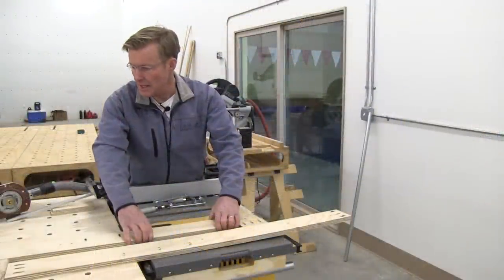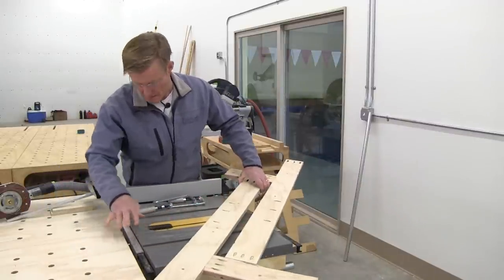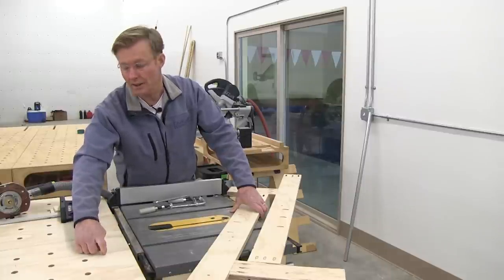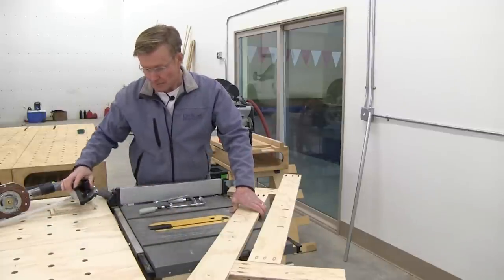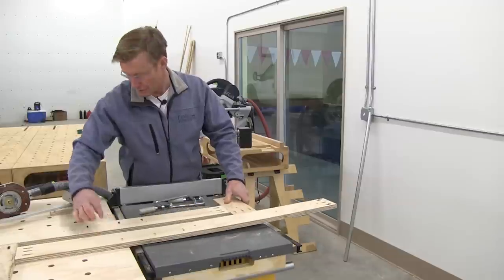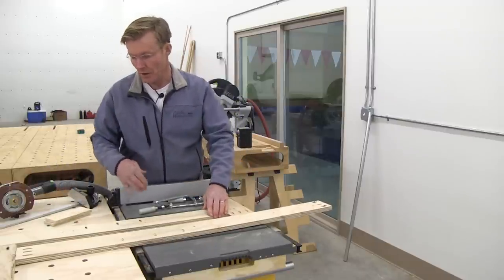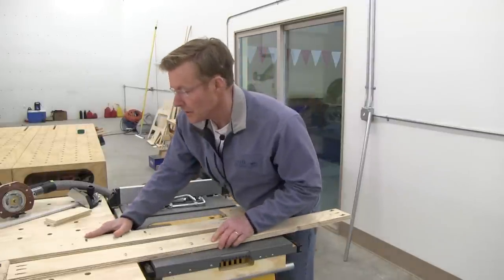The last detail on the workbench is to cut out the dados here for the miter gauge. I just took a straight edge, lined these up, and made marks where it needs to go. I'm going to make the dado actually wider than that and a little bit longer than I need — there's no need for this to be a tight fit, it just needs to be a run-out. I've taken this same pattern I used for the other cuts and adjusted it — made it an inch and a half wide, just took three pieces of half-inch plywood, got the spacing I need, and using the template it'll become an eighth of an inch narrower. I'll eyeball this and clamp it down with the Festool clamps.